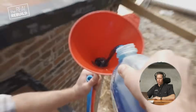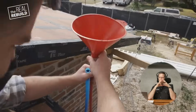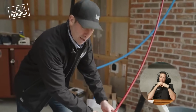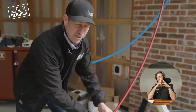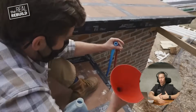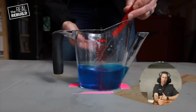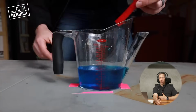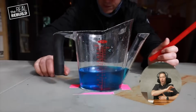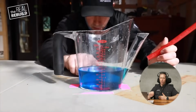I'm going to fast forward here a little bit to the results, but basically what you're going to find out is that a 3/4-inch pipe holds double the amount of water in a 10-foot section, which means that if you plumb your house with 3/4 lines everywhere, you're going to have to move twice as much water through, and especially thinking about hot water, dump down the drain before you get hot water delivery. So what we need to be really cautious on is making a trunk and branch system that requires the smallest pipe size that we can use to get the volume out of the fixture.